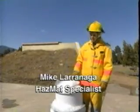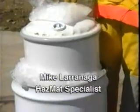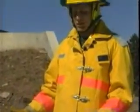Another method of dealing with a pressurized drum is to apply ice or dry ice. By cooling it, we reduce the pressure and decrease the danger when eventually you have to open it.